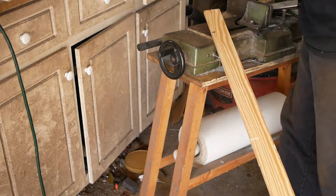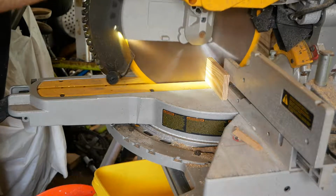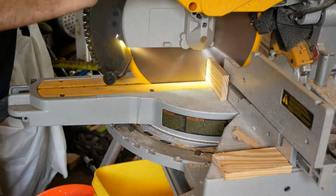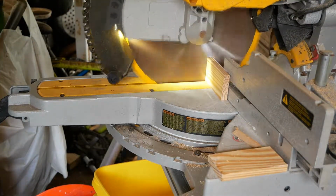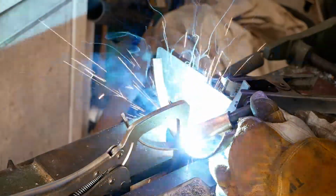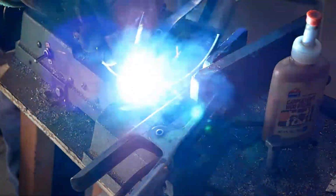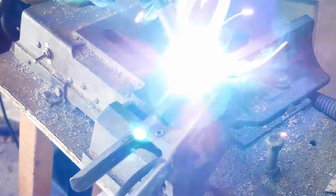The third bracket style I don't actually have any video footage of, but it's essentially the same kind of steel that I used. I just bent it into a U, and those are the ones that I used to hang some of the other blasters. To create the crowns that hold the helmets on, I just took some more of that flat stock, bent it around that same brake drum, and welded it into a cross shape, and then welded it to the ends of the other pieces.